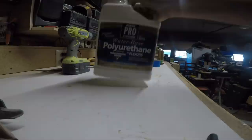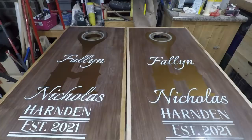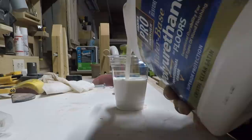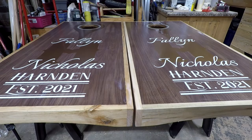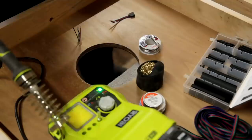This is Mark's Pro — a Home Depot product — in satin or semi-gloss, recommended by professional cornhole board makers for the right surface slip. If it's too sticky the bags won't slide; if it's too slippery the bags slide off. So we're watching a time-lapse of paint drying — I did about four coats, which was probably too many as it started to get a little cloudy, but it's pretty sturdy. It's a water-based finish designed for hardwood floors.